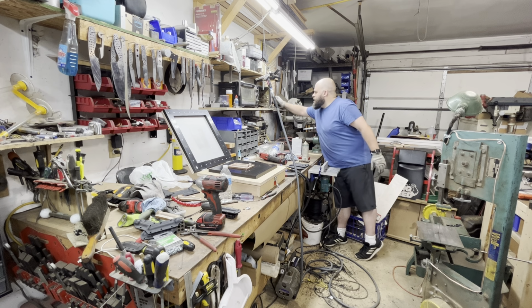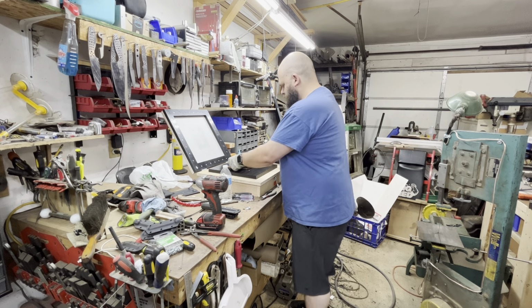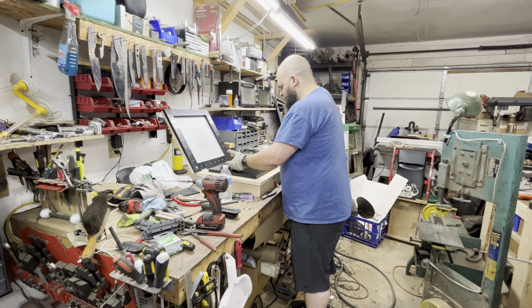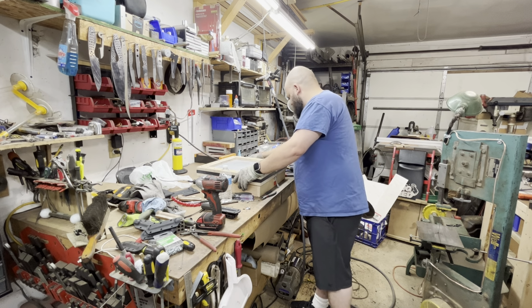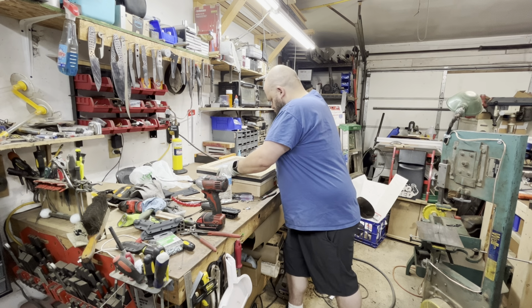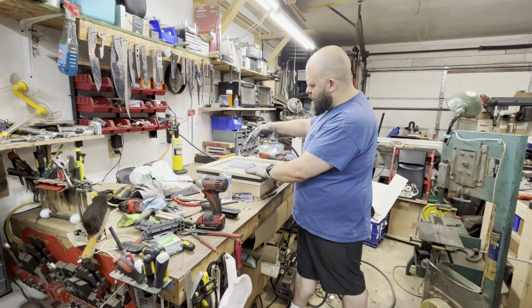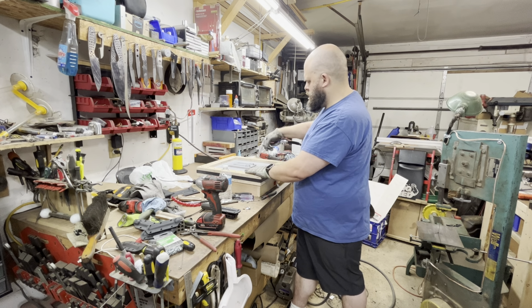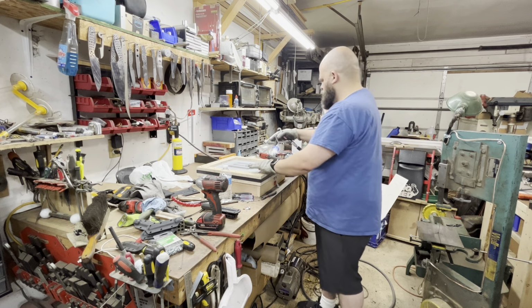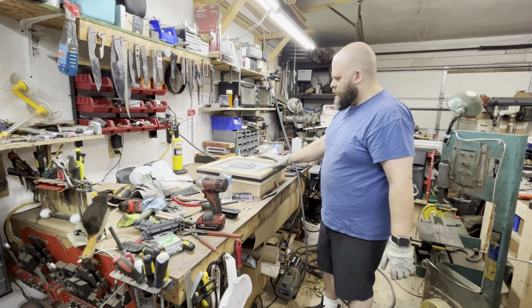So that's 2 minutes. We are nice and pliable. Gonna stick it over, roughly center it on my mold. Close the lid. Make sure my supply valve's open, vent's closed. And we're just gonna go ahead and hit it with some compressed air to help cool it faster. This is still pretty hot, but it's already taking a set. I'll let that cool inside the press just for a little bit more while the vacuum's still applied.